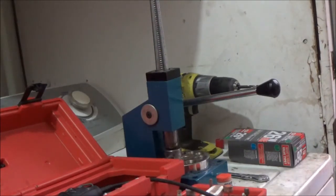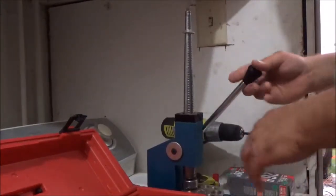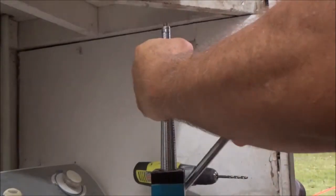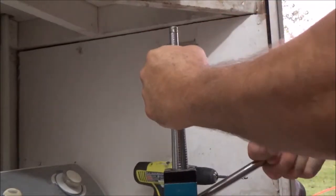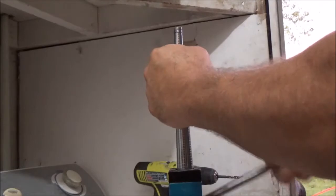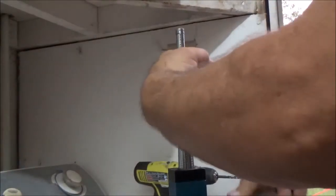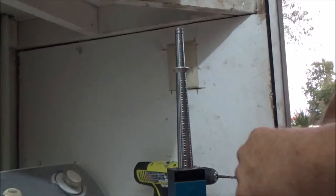We'll move you here so you can watch me work on the ring stretcher. Let me take the ring off the other side. Like that. What I'm going to do is stretch it a little bit, turn it, stretch it a little bit, turn it, and just keep doing that. If you'll notice, it's going lower and lower on the stretcher. What you want to turn it for is to keep these splines from leaving marks on the ring.